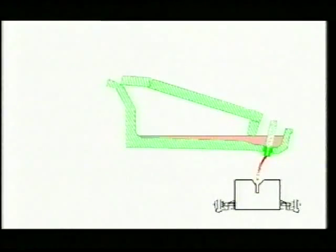Notice the slag trap between the bath and the pour box, which excludes air from the body and keeps the pour box clean — very important for ductile iron. As pouring continues, the body moves further to the right until the maximum tilt is reached. Even in this position you can still pour manually, but the level will drop with a risk of slag in the nozzle.